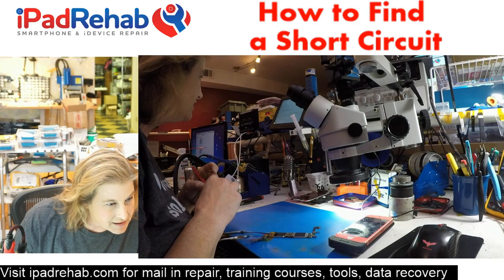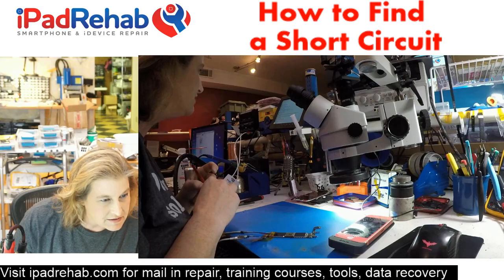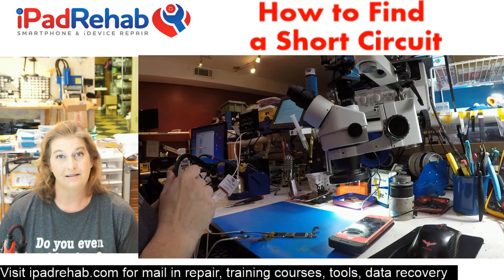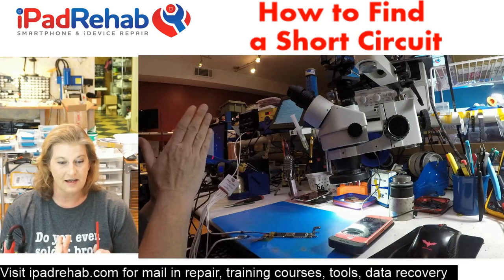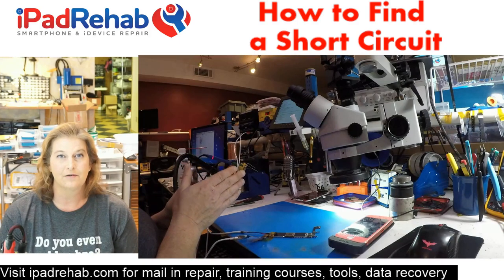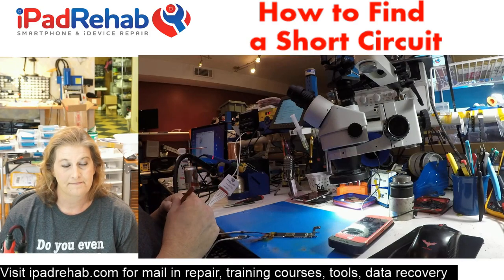All right, FLIR cam or blur cam? Which ratio percentage you had the hottest is really the bad component? Ooh, that's a good question. So Juan is saying, how often is the component that shows up the hottest the cause of the short? And I would say 50% of the time.